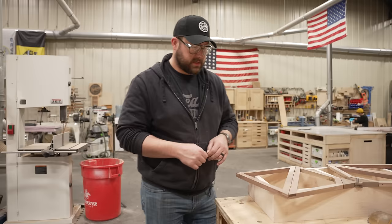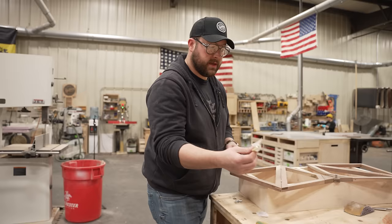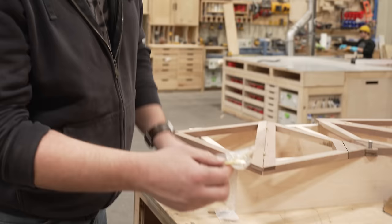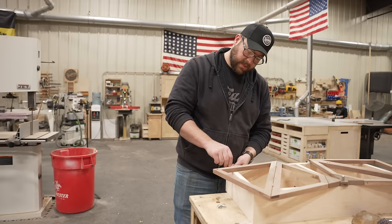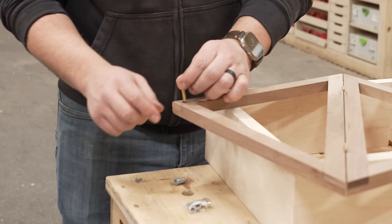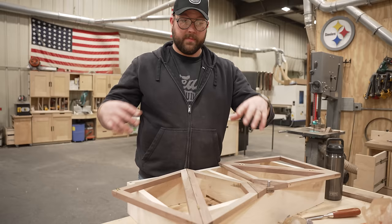So we've got all these brass hinges on here already. Walnut and brass do look good together. So I was at the store, and I was like, our dude in the video used black hardware, so how can I do something similar? I started looking around and they had some pretty nice looking brass plated hardware. I can fix these holes and re-drill them and you won't see it because of these nice fat heads. Then I can put a threaded insert in here, and the holes are already drilled. That will allow me to use this nice looking fastener on the front that we're matching here. This one's a little bit more polished. And then I can rebuild this over here to use that plate mechanism that the dude had in his.